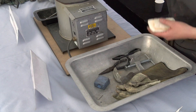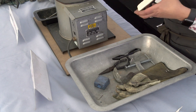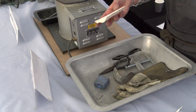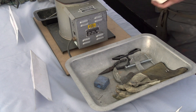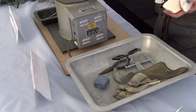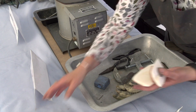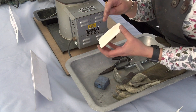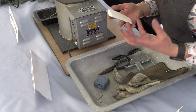There are so many techniques and processes you can use with pewter. With casting there are a lot more experimental ways of doing it. There's cuttlefish casting - you dry the cuttlefish and then you can actually cast straight into it, so it picks up the texture of the bone on there as well, which is a really simple way of doing it. You do it with silver casting as well, but with silver the temperature is so hot it actually destroys the cuttlefish.